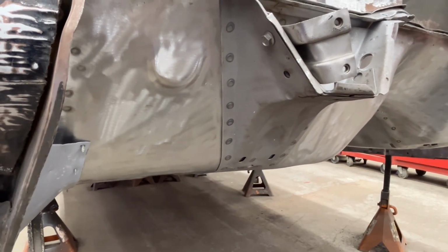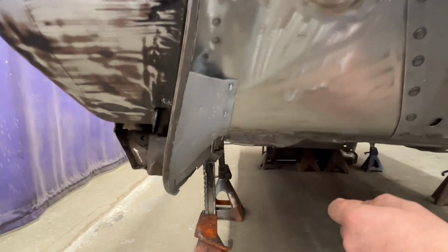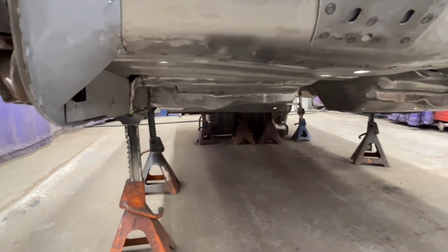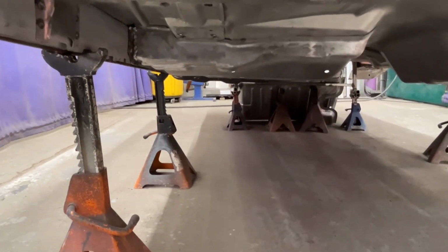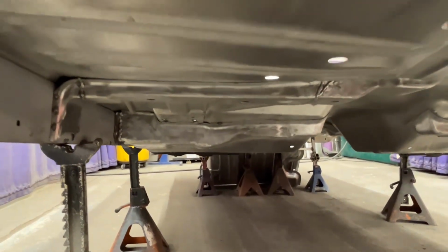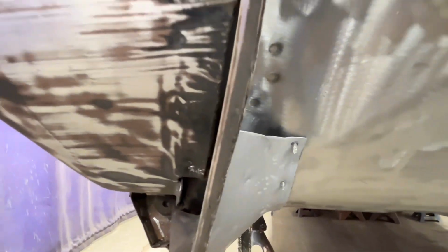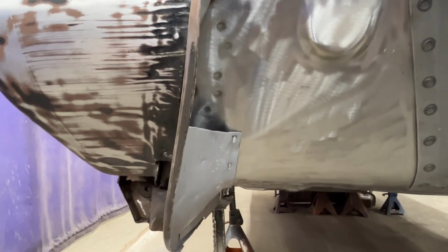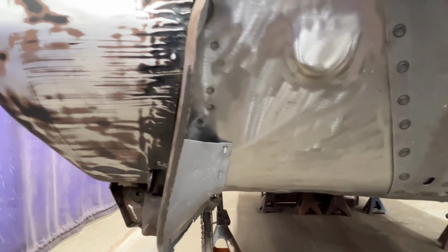Nice. And we still got some welding happening here yet. The braces aren't fully put in, and some of it still had to be plug welded. If you take a look all underneath, you can see all that nice brand new shiny metal. Now these screws here in this area, that's just to hold it in place before it gets welded, correct? Right, it's like a clamping because we couldn't get any allocation for clamping. They're just sheet metal screws, and they'll come out, of course, and be welded up.